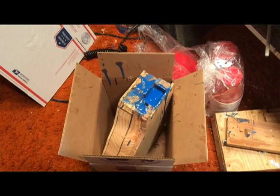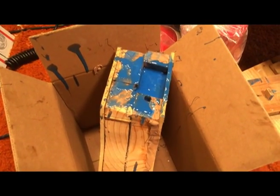So I stopped. I had some other pieces that needed to be molded, so I was able to salvage that, and then pulled the mold box apart and cut a bigger opening. Fortunately, the silicone that went in was fine, no problems, no leaks around the mold box, and it's ready to be demolded.